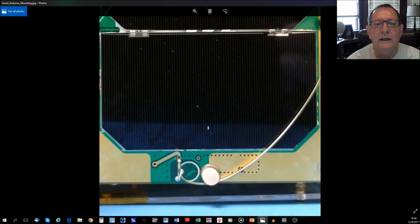We've made a change to the way that we do the antenna attachment, and the new method, as you can see, requires a staple, and then the antenna, the nitinol wire, is soldered. It has a little bit of wire wrapped around it in order to provide more solder area. That made a big difference, and with AO-91, as I said, all of the improvement is through the fact that the receive antenna works the way it should. So what you're hearing is the way the Fox 1 satellites were designed to function as an EasySat, and as a matter of fact, I think we exceeded that expectation with the ability to work the satellite, of course, when it's not crowded, with an HT and a whip, and power is reported as low as 100 milliwatts.